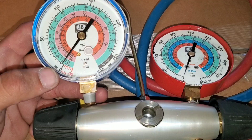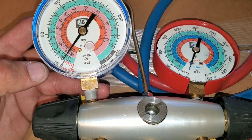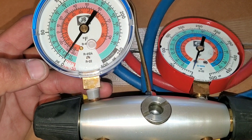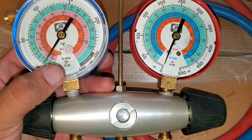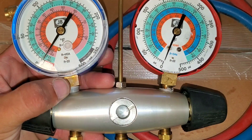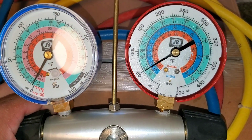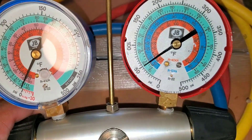Here I put my threading on. Now we're going to go ahead and put our gauge in. When you're tightening it, don't over-torque it — don't put it too tight. You want it to be just nice and snug. I just basically hand-tightened it, then I'm going to take my crescent wrench and give it one nice turn. Now we're going to go ahead and remove the gauge for our high side.